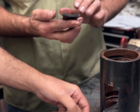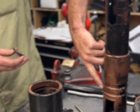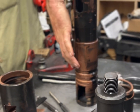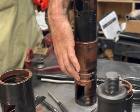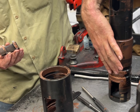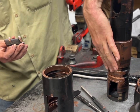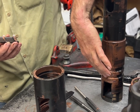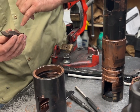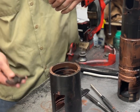And the more you use the tool, this latches on this. So the old tools, this could get rounded off or this could get flared out. So if you're ever repairing a tool, look out for this shoulder to be still smooth but sharp, not completely rounded off. Same with this one. You don't want it to be folded out or completely gone until fully fallen off.